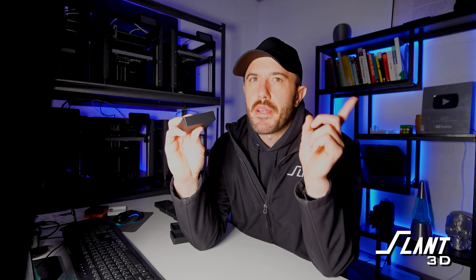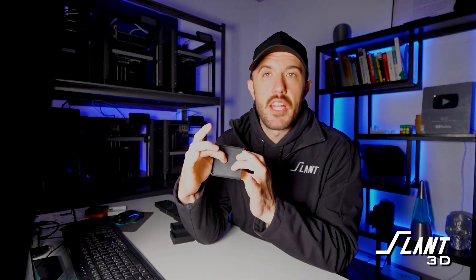The operating theory is that you have a bunch of material inside which takes longer to print and also more material to shrink. So at the transition from this thick solid bottom to just these thin walls, you have a transition line. That may be true, but let's go ahead and check it out.